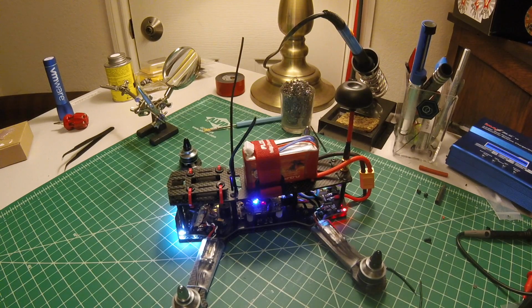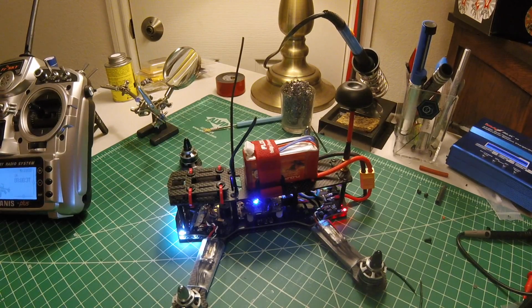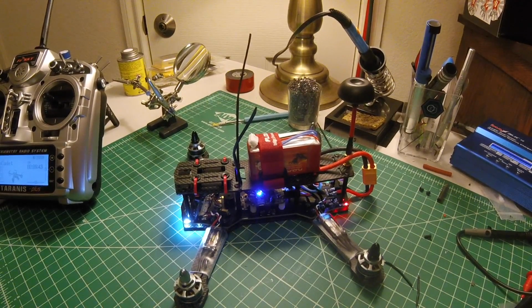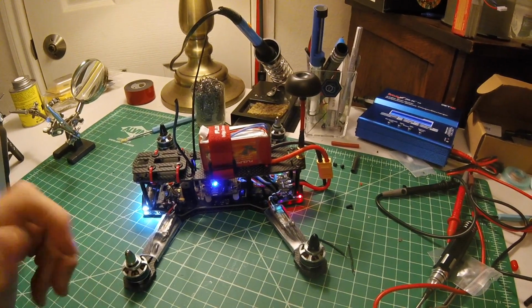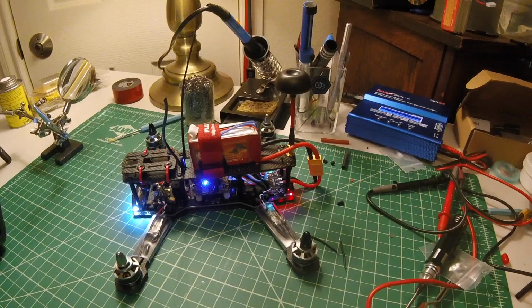Arm it here, and you can see I got my motor spinning, and they respond. So I genuinely am not sure what the challenge was, or what's not working. I guess the board still won't accept power from the computer. So if you try and power it over USB, that's still not functioning. I got another flight controller on order anyway, and I maybe need to figure out a better way to hook up VBAT or not.